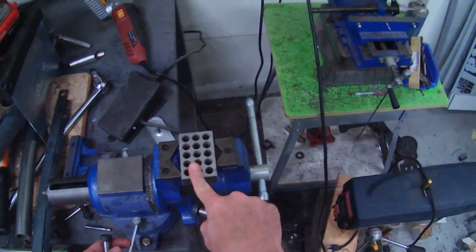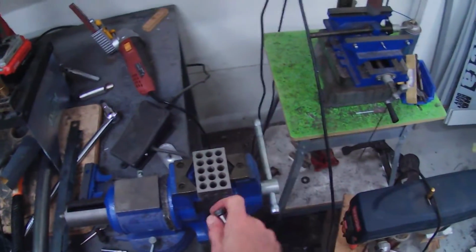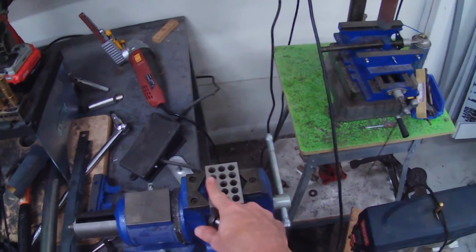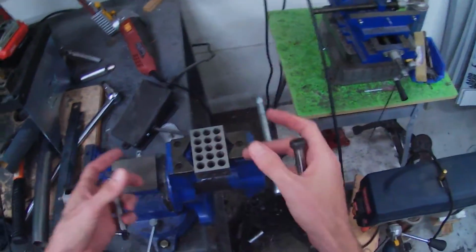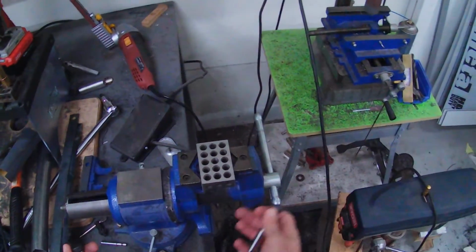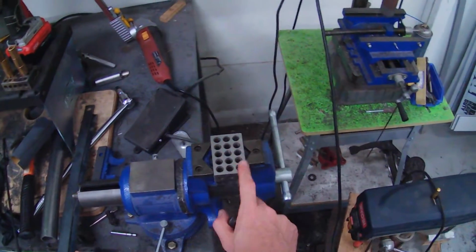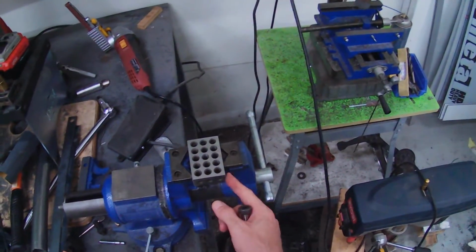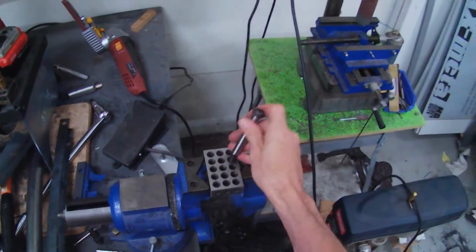1, 2, 3 blocks. If you're any kind of fabricator, you have to have them. You need them. You need dozens of them. They're super cheap on eBay. They don't even need to be so super precise that they come in a little box and then you pull them out because you're a fancy machinist. You can just use these for woodworking. You can use them for plastics fabrication. You can use them for everything. They're exactly 2 inches by 1 inch by 3 inch, and they make great layout blocks.